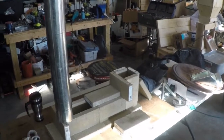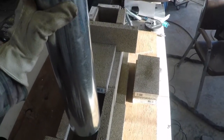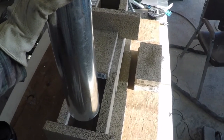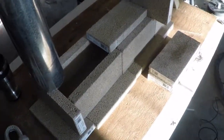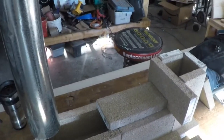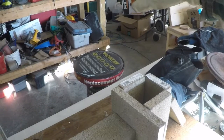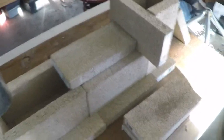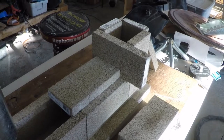This is what I'm going to try first. I'm going to build a little bracket to hold this four-inch vent tube up, keeping it up quite a bit so lots of air gets in around the ends of the sticks. I'll form these refractory bricks with another layer up, so it'll be about this tall. It won't be ideal as far as the rocket stove calculations go, but it's just to give an idea of what it'll look like. I can't afford to buy a pile of these bricks just for testing, so we'll do two layers high — a little short, but we'll see how it goes.